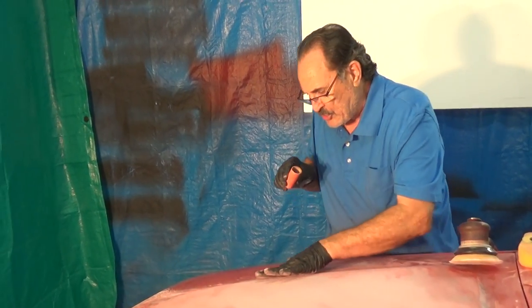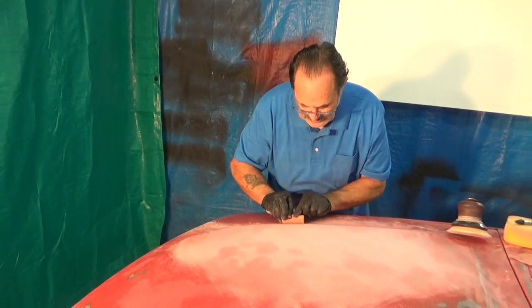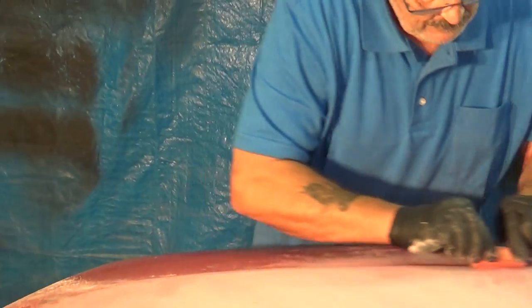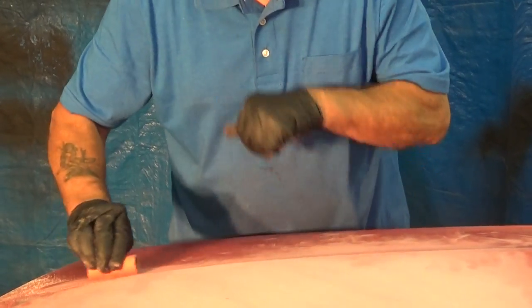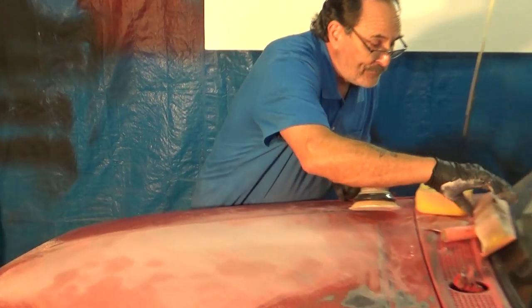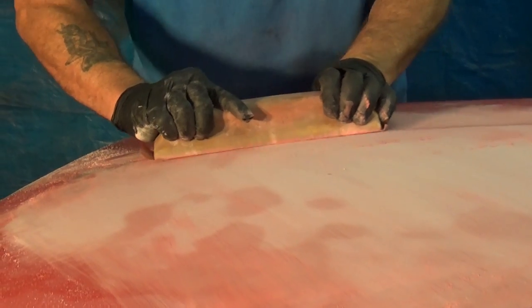Right here where this contour comes down, I mentioned in my first video about this little cylinder of cardboard — I wrap a piece of the adhesive sandpaper around it and make sure it fits the exact contour of that low-high offset right there. Make sure it goes all the way down in there evenly, because if it just hits a spot at the bottom you're going to have high and low spots, and you don't want that. Now where this is at, if I want to make sure it's smooth across there, I go across it and make sure it's feathered down — it's called feathering.